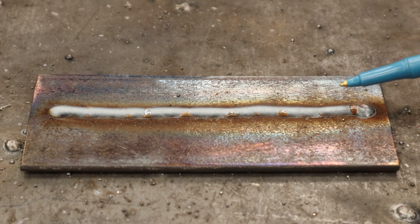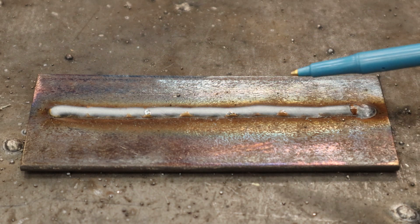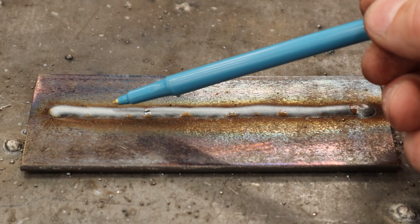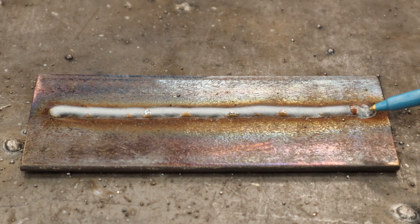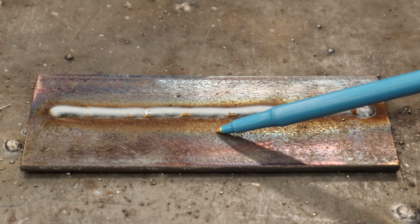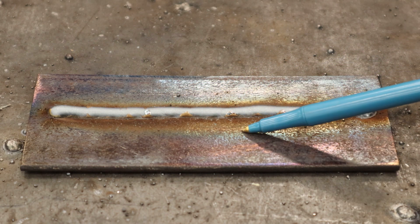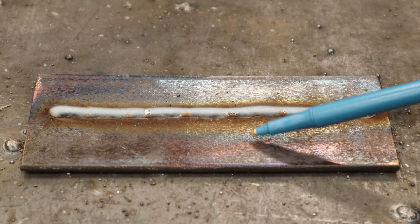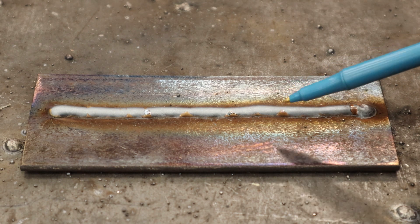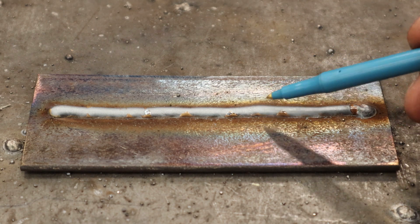With this weld sample it's a little trickier, because at first glance there doesn't look like much is wrong. We don't see excessive carbon, no excessive spatter, no porosity, the weld bead looks nice and straight, and travel speed has been very steady. However, it has a telltale sign that the setting is too cold and wire speed is too low: it's literally sitting up like a worm or a piece of bird poop on top of the metal surface, because it simply isn't hot enough to melt or penetrate into the base material, giving it good strength. This is a con for MIG welders — in untrained hands these things can make beautiful-looking welds that actually don't hold anything.